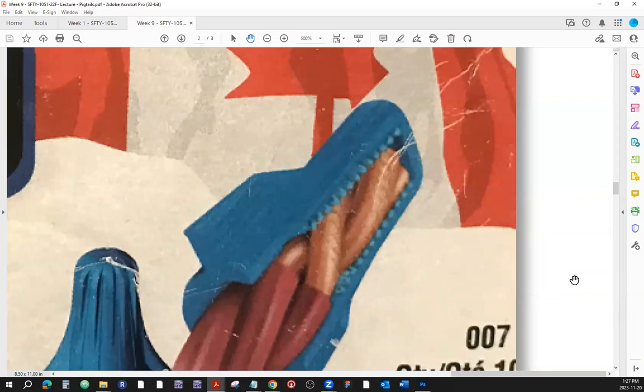Remember, during the last lab, I'm not sure which section it was, we looked at the receptacle that was by our desks there, and we looked at the footprint of that. That's the footprint of a 15 amp circuit. The ampacity of that circuit was 15 amps, which means it can provide up to 15 amps of current. Does it mean that whatever you plug into that, there's always 15 amps? No. It can supply up to 15 amps.